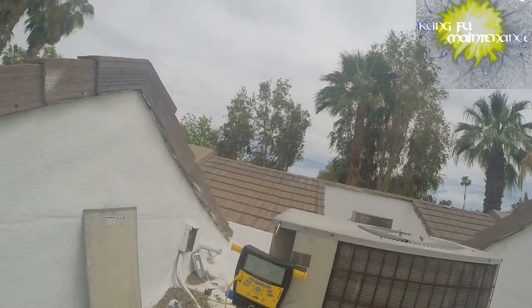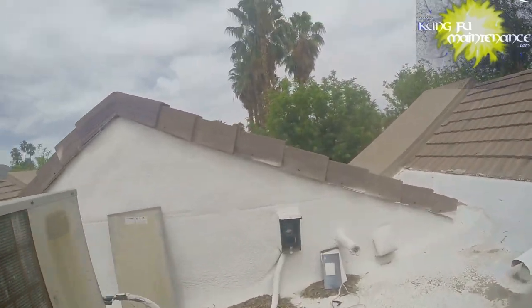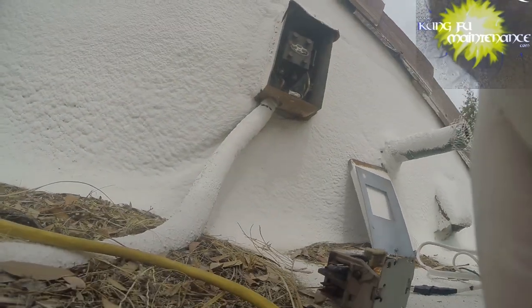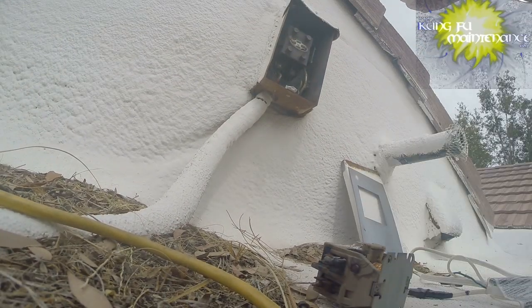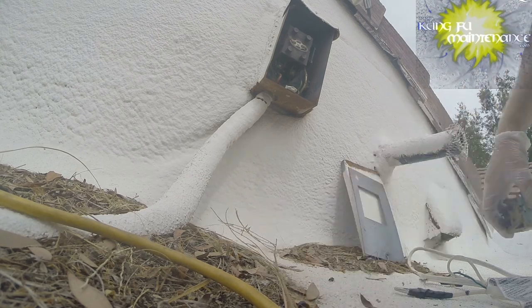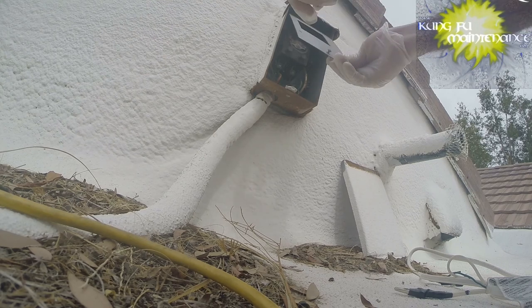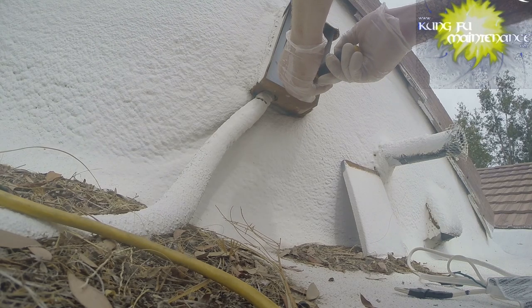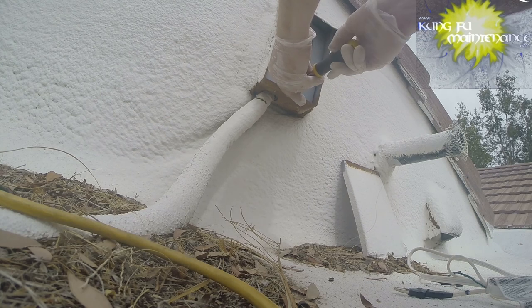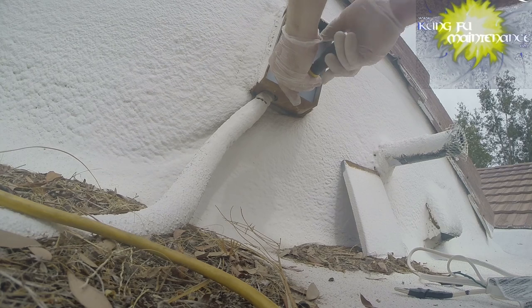Yep, I can put a few things together in the box over there. We're all done. I'll start packing my stuff up here. Normally I'd recover the refrigerant from the high side into the unit. I have another unit to charge though, and I'm not going to recover it because it'll affect our superheat even more, and it's the wrong way, so I don't want to do that. Might as well use the refrigerant for the next job.